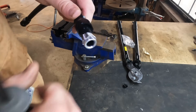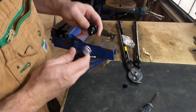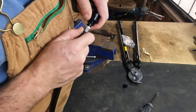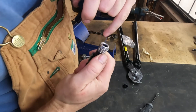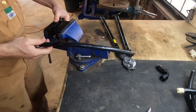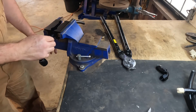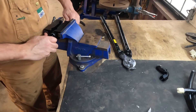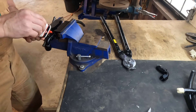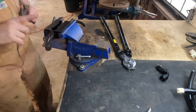Once we've got that, we can put the fitting edge in and slide it in there nice and gently. What you don't want to do is fold the inside of the PTFE hose, so just feel that it slides in nicely. At this point we're going to use our soft jaws and install the nut into the soft jaws to hold it, then slide everything all the way in until it makes contact. Put a drop of oil onto the threads to help so that they don't gall.